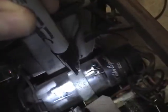I'm also going to take a Sharpie and mark the location of this magnet and these other various bits so I can put them back on, because the position of these is critical to getting a good sharp picture. Also take a few reference photos. Once I do, I think it's really going to open up all this stuff and I'll be able to finish recapping much, much easier.